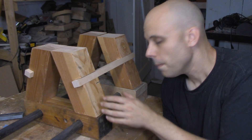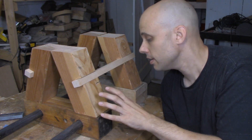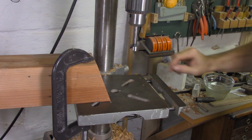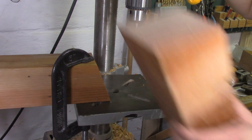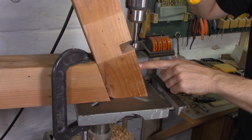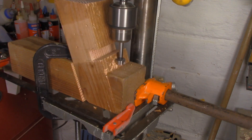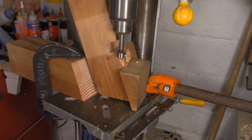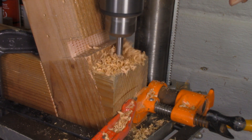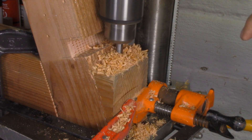The basic structure is really good, but I have to have a way to tie these uprights down to the wood blocks that make up the bed. That's tricky because of the slant and because I have an end grain to flat grain connection. The best way is probably with hardware, so I jigged up my drill press with one of the offcuts from making the uprights. That gives me the correct angle so I can use a Forstner bit to drill straight through and make a countersink for a washer and a lag bolt. That did not work. I adjusted my jig because the Forstner bit just couldn't bite down at that steep of an angle — I had to give it something flat to bite into. After rearranging the jigging and trying again, it worked really well.